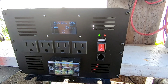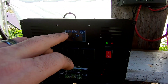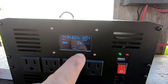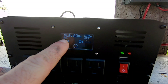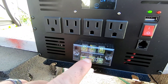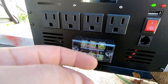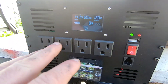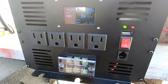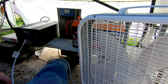With the charge controller, we have solar coming in and the battery connected, and now the inverter is hooked up on the battery. The 120-volt output is live — we're reading 14.2 volts, which is consistent with our charge controller. Currently zero watts going out, and the display shows a smiley face indicating a full battery charge. We're in the on position. The lugs on the bottom allow you to hard-wire electrical connections rated at 600 volts, 25 amps. There are also four standard outlets to run items.